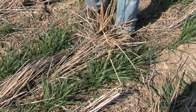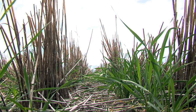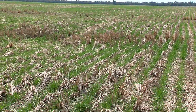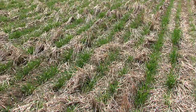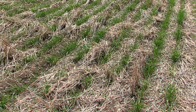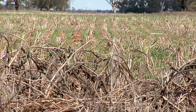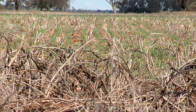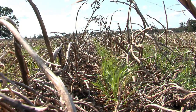We could get all the soils to germinate, particularly the chocolate soil, which we have major problems with because we mix up dry with wet soils. The red soil's fine, the black soil is fine, but the chocolate soil doesn't seem to germinate well after sowing with the old machine. Fantastic — sowing the chocolate soil with the disc planter, because it didn't mix up the wet and the dry soil, it all came up just beautiful. Very happy. Where the seed was placed, it made it very easy for it to come up. It wasn't smearing the soil with the press wheel, and it came up very easily on all soils — the sandy, red, chocolate, and black flood plain. The seed came up very well.